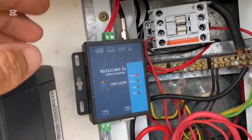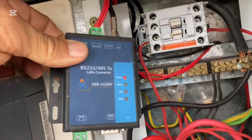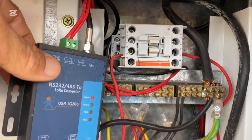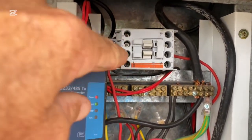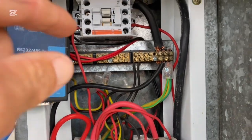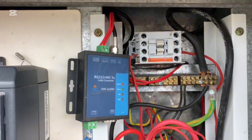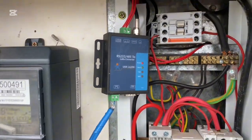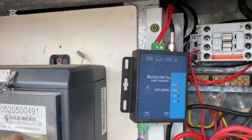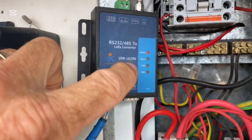This particular setup here is definitely not ideal. That should be located somewhere away from where it can contact any live parts, such as on this contactor — and in fact, that contactor's not ideal either. That should have been DIN rail mounted in a better location. But it is what it is — it's not my install, I'm just making the thing work. I've just installed the antenna and we're away now. It's working good.